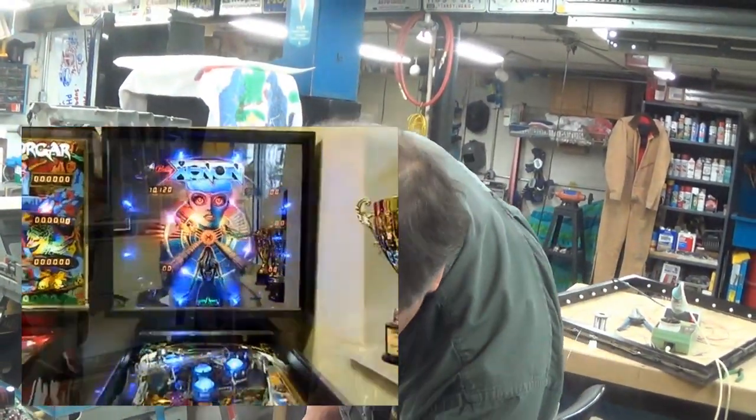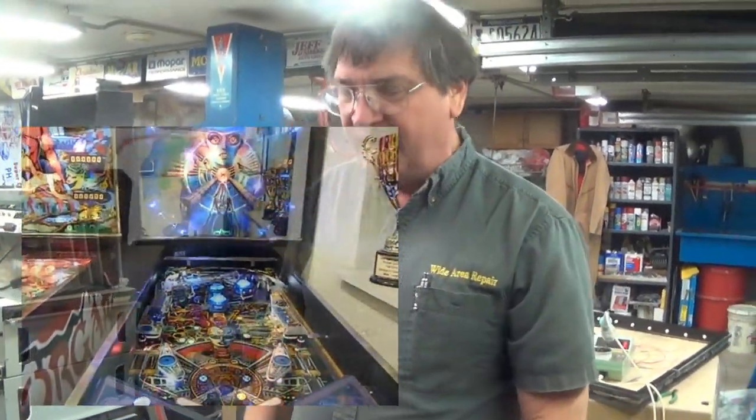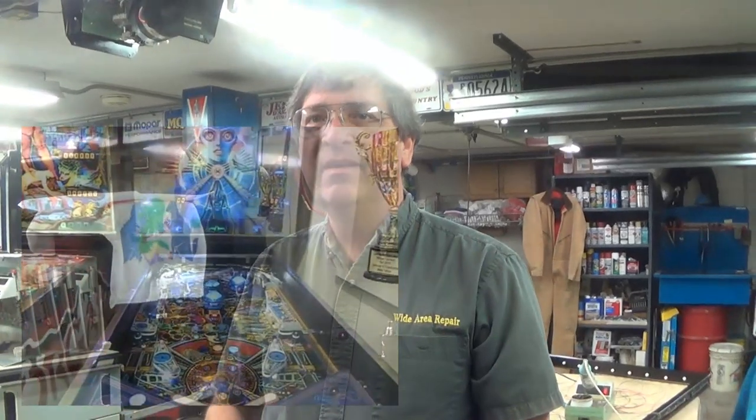The way they did it to display wasn't like the pinball because they had no brain. They didn't have the time to create what I'm doing. Right. The pinball machine does this through a circuit board. And chases. And I think the circuit board's controlled by the CPU, so you need the whole pinball machine to make this work. Now, the GI is a simple thing because it's just illumination. Make the voltage. The chase lights, that's a totally different thing.